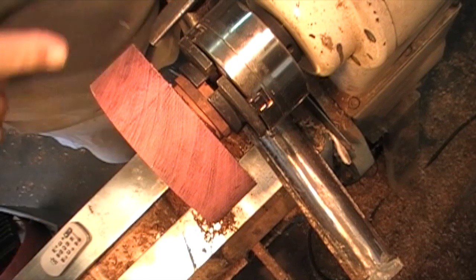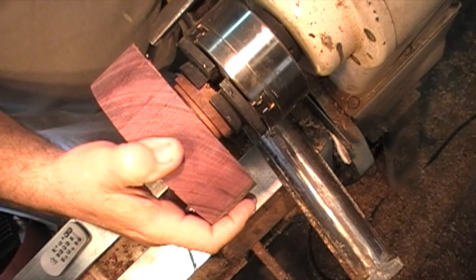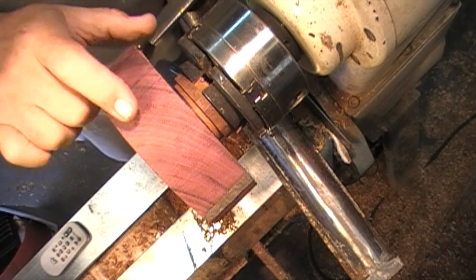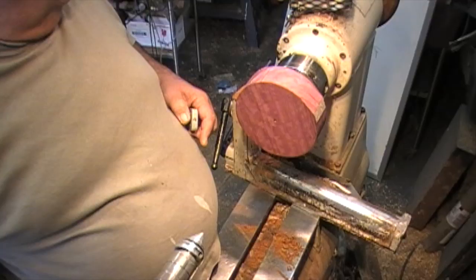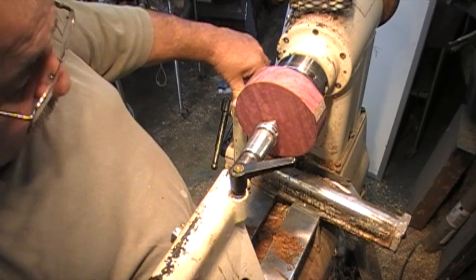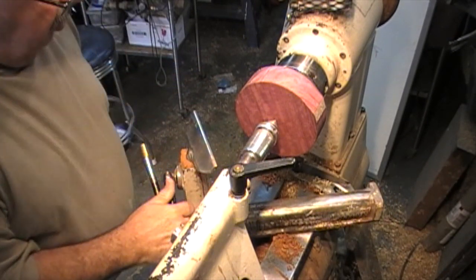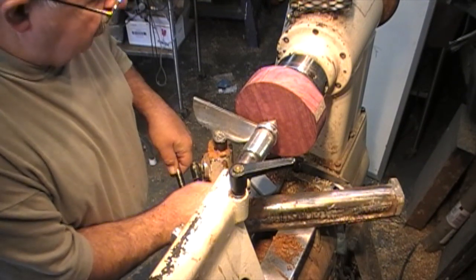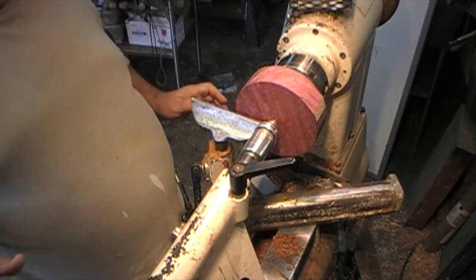That's my glue block down there — it's a piece of mahogany. This is my Purple Heart glued on there. I rounded it; it's about six and a quarter inches round, a full two thick or eight-quarter thick. Now even though I'm on a glue block, I'll bring up my tail stock while I rough it in first and get it spinning. That's a safety feature — remember, if you can turn between two points, you're much better off than starting off on a face plate, glue block, or a chuck. Just stabilize the piece; if it's got some wobble, you can straighten it out and get it running right.